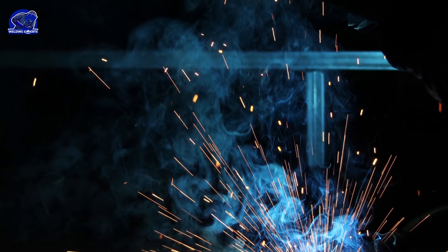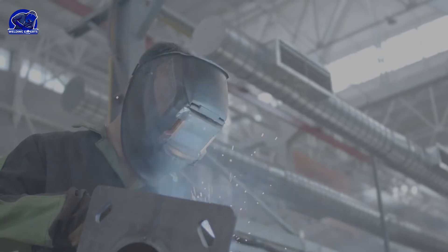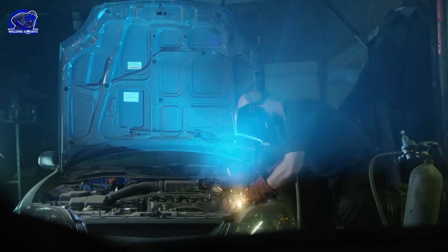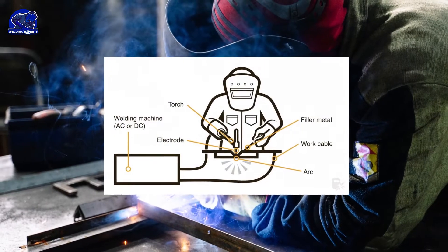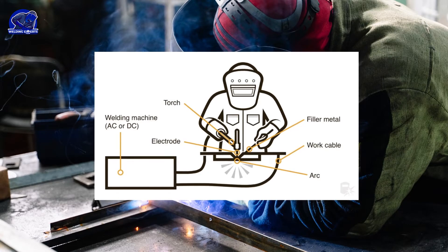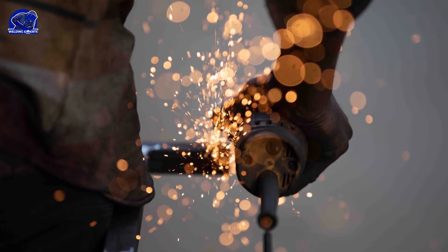It is important to review the theory and practice on scraps with different settings. Relax your hand and remain calm — having control over the weld pool requires a good welder to relax the hand, especially the wrist, rather than gripping the gun or stinger too tightly. Making the arc can be very difficult for beginners. The welding arc should be struck exactly at the beginning of the welding bead. Performing it outside the weld joint, on a table, or on scrap material is a common beginner's mistake.